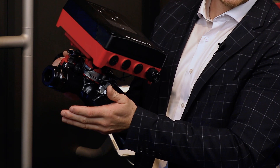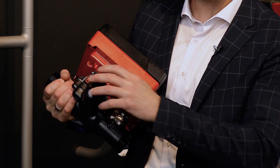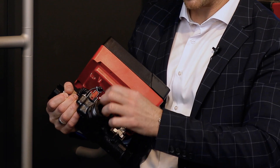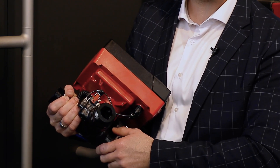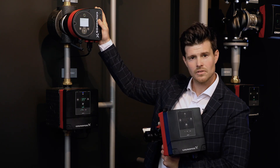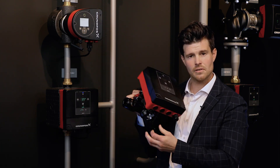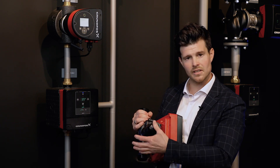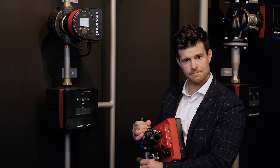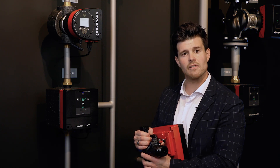This is the supply side on the primary side, where we have a temperature and flow sensor placed. The return temperature is measured in the bypass via a temperature sensor there, along with a non-return valve that is easily changeable. The mixed temperature comes from the pump and the data is shared wirelessly, so we have all temperatures and flow — which together also give us power and energy.